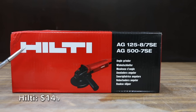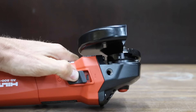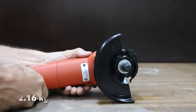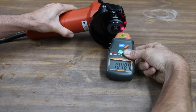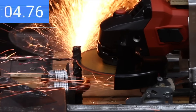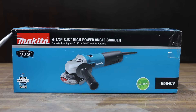At $149 is the Hilti. You can change the blade guard angle without tools and it offers two different handle positions. It includes a 6-amp motor running up to 11,500 RPM. The Hilti weighs 4 pounds 12.3 ounces, is relatively quiet at 91.8 decibels, and made it to 10,510 RPM. With only a 6-amp motor compared to the 11-amp DeWalt, Metabo, and Milwaukee, the Hilti lost a lot of blade speed, making the cut in 7.5 seconds.